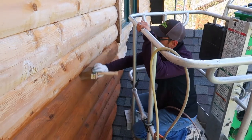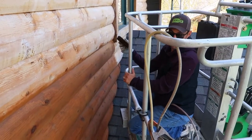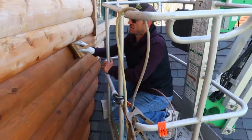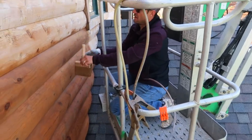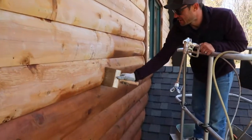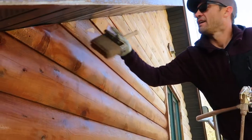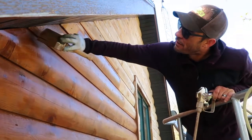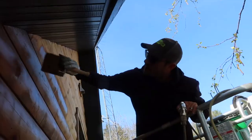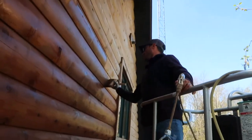If you don't back-brush in time, you end up having to brush twice as much. After a couple days of holding this two- or three-pound brush in your hand, your wrists tend to get a little sore. Just taking two logs at a time, making sure it's a nice, even, consistent coat and flooding the surface. Then I put it on kind of heavy, so I'm just going to hit the bottom of the log, bring that up so it doesn't drip down — come from the bottom and let your bristles do the work. That's why it's so important to have a high-quality stain brush. If you go buy the little $6 do-it-all brush, you're not going to be happy with yourself.